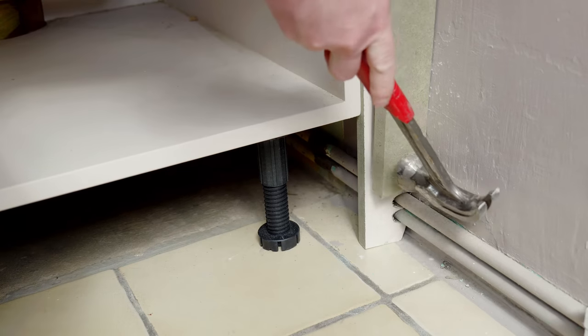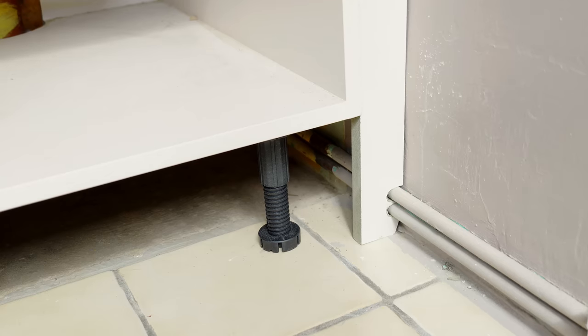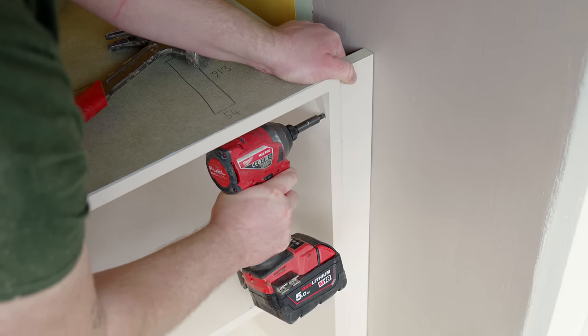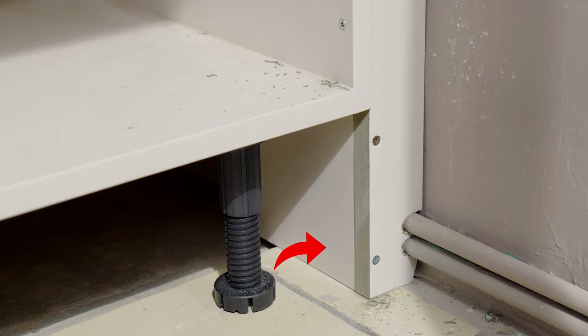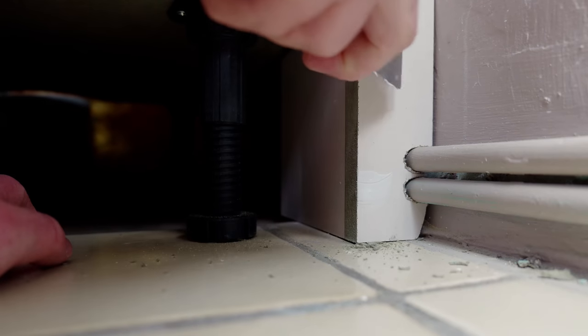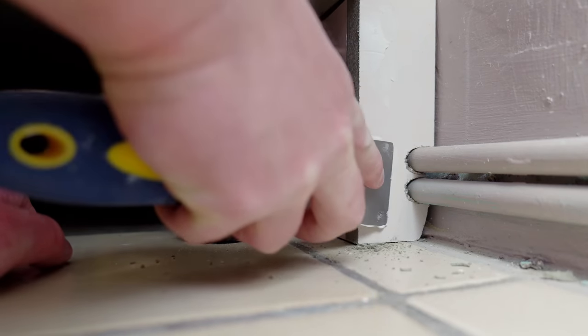This is the infill piece and I cut this to fit around the copper pipes and fit nice and tight to the wall. It got secured with screws, and I also later added another L bracket just to support it at the top, then I added a little return at the front which the plinths can later butt up against. Since this piece is so low to the floor I just screwed it in place and then I can fill and paint these screw heads to hide them.